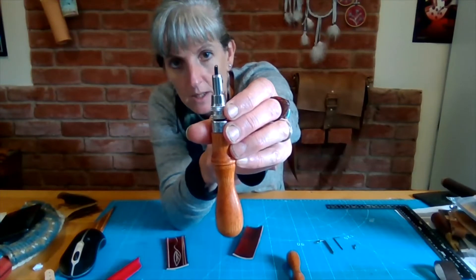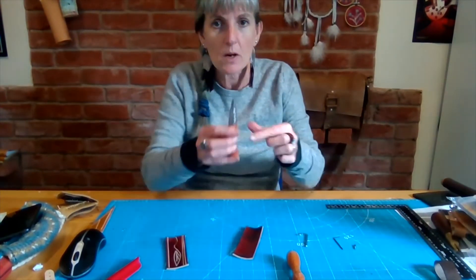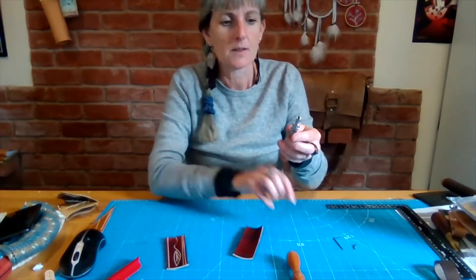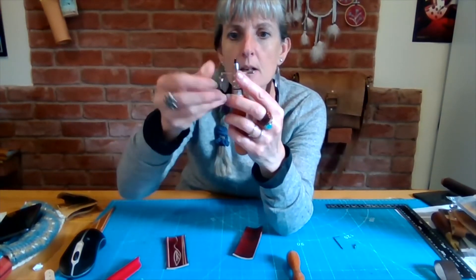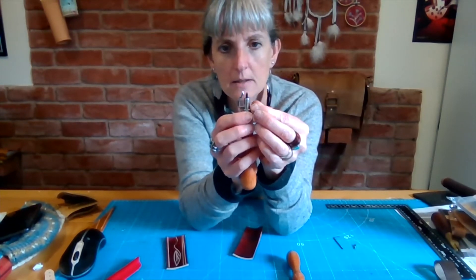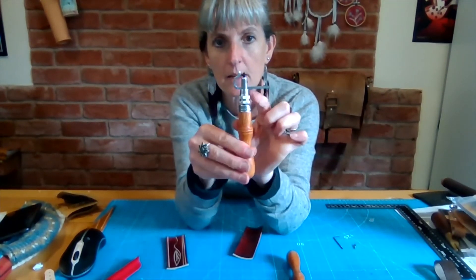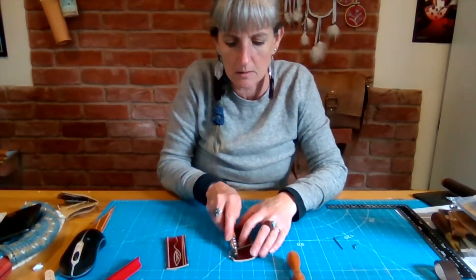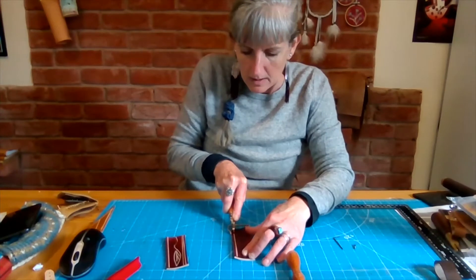You can see the hole for the groover and you also get the guide. This works in a different way. We've got the groover in the tip center here and I've tightened this in position. There is another hole here for the guide to sit in. The guide will go through and I'll just loosen that chuck off, then I can turn that and make that however I want my stitch seam allowance to be. I've tightened the chuck there — that's the chuck bit. Tightened up that guide. I can now use this to go down and carve out my channel.